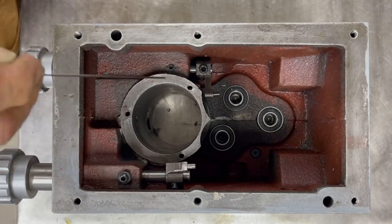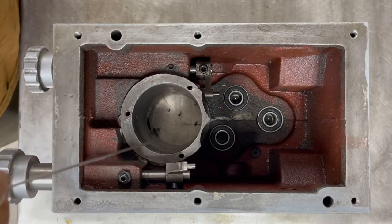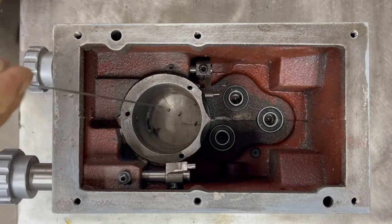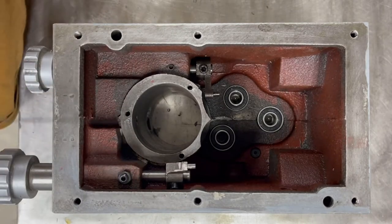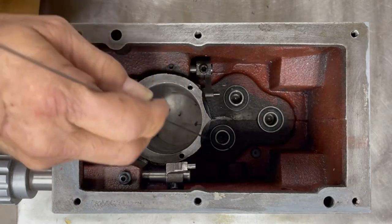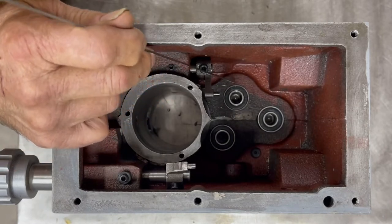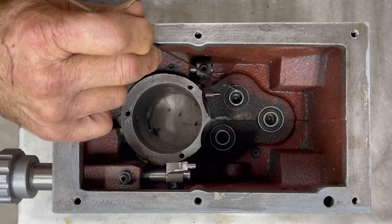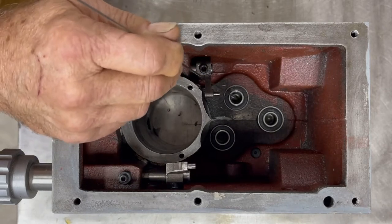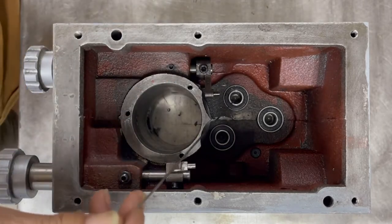This is where the seal hub mounts, where the upper gear goes down through for the quill to move, and there's a couple of seals up in here, and they're held in by three cap screws. You can see in the bottom there's three bearings, little tiny ones. I think I got the number, I can't remember what it is right now, but they are pressed into the bottom. I did not take them out because I don't need to, but there's an important tip about these.